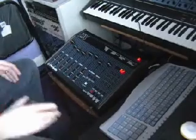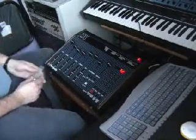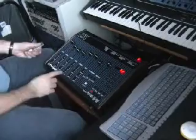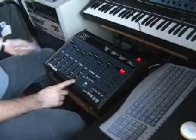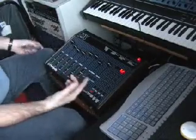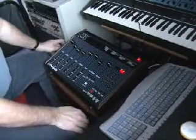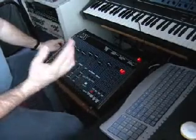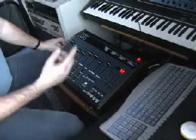I'm going to show how easy it is to change the sound chips in this machine. At the moment these sounds are all standard — this is what came with the Oberheim DX. The claps are the same as they would have been. We don't have the shaker in there at the moment. I've got some rim shots in there which are actually from the Sequential drum tracks, so it's downloaded, burnt into a WAV file, and then put onto the Oberheim EPROM programmer.